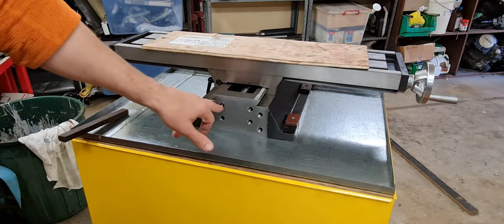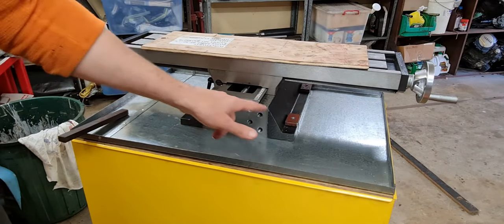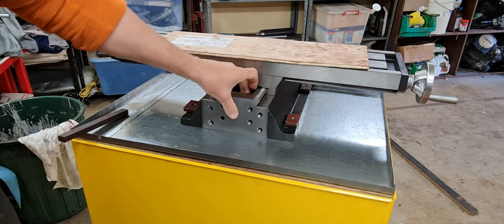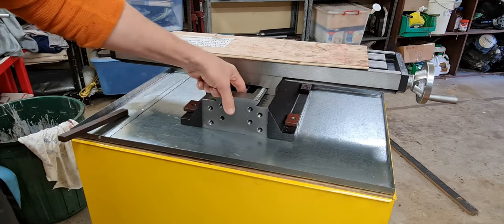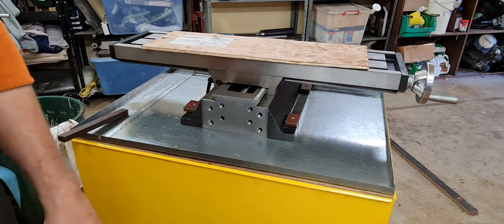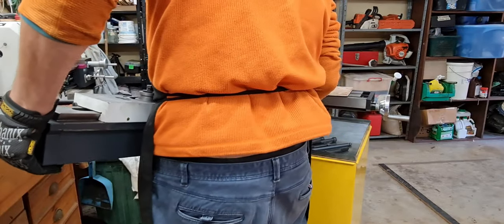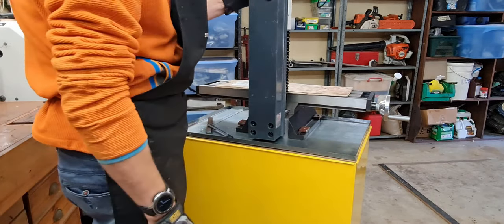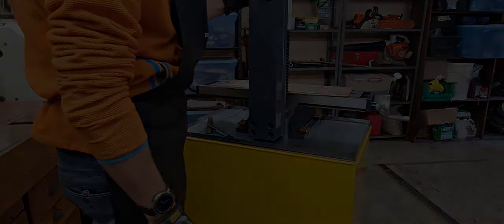I've cut the four new holes — it's looking a bit like a piece of Swiss cheese now, but I don't think it'll affect the integrity of this casting. There's quite a thick piece of steel behind here. Now we've got to see if my drilling was nice and straight and all the bolt holes go through. The video has been going for a while, so we'll make this a two-parter. In the next video, we'll go through how I align the column to make sure that the milling head is perpendicular to the bed.